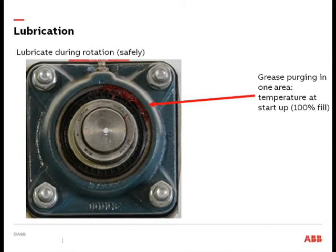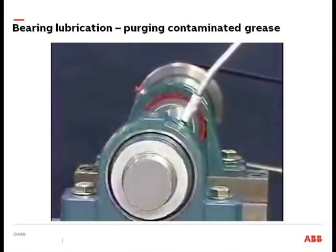This video shows bearing purging in action — as we pump grease into the bearing you can see the grease developing at that area. When you see fresh grease developing while it's running, that's when you stop. You will see a bearing temperature spike on a brand-new bearing and also when you're re-greasing — that's okay, that's normal. What you don't want to see is the temperature trending up and just keep going. That's when you've got a problem.